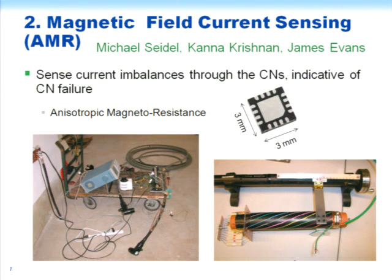So we did that with a number of jacketed cables, but we kept hearing that the concentric neutral problems are really most extreme, most of interest when you have unjacketed cables for direct buried installation. And so we have some cable that we were given by one of the 3 IOUs in California. So this is cable that's not jacketed. It's been in the ground, and so it's somewhat corroded and so forth.